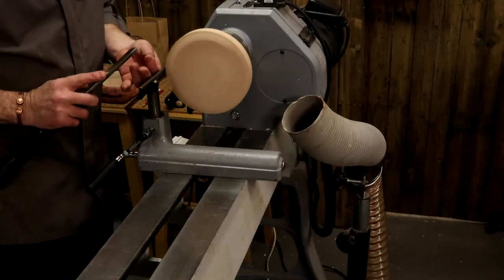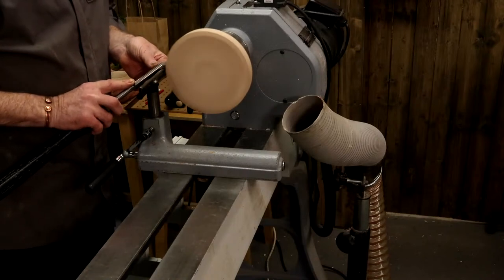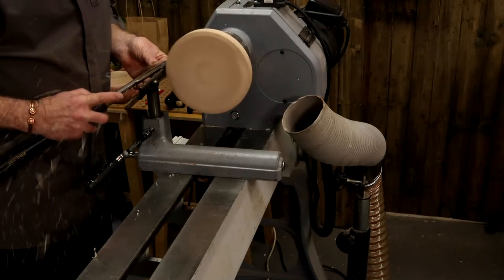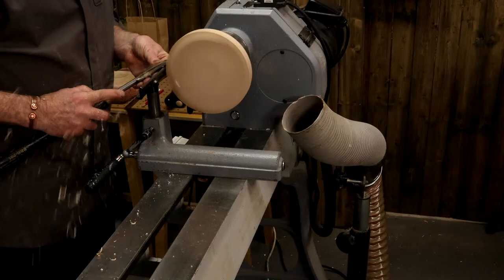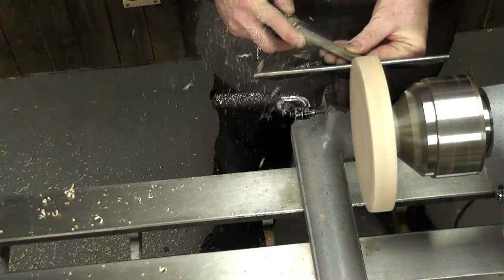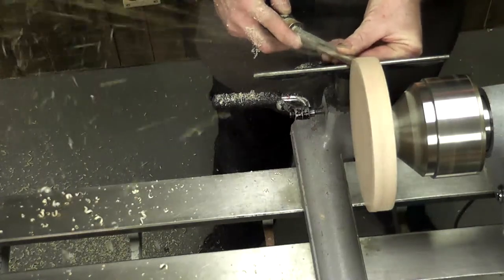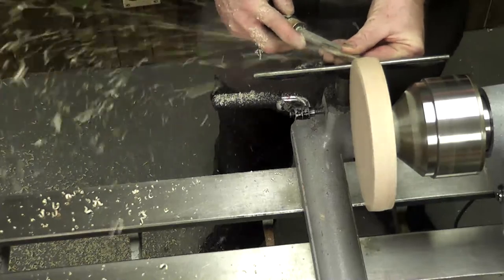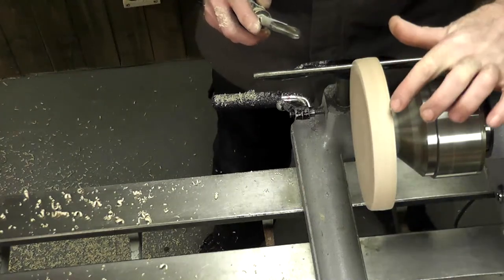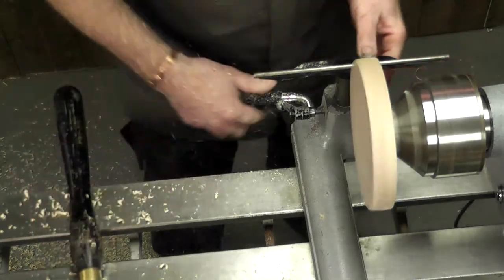So, finger and thumb, left hand, so important. At the moment, I can make contact just with the bevel. Flute is facing me directly. I can roll it. I'm going to push across. Now, as much as we've cut it to a circle, we're not 100% round. Left thumb's doing all the work at the moment. Now, pushing it across, right hand follows. As we said, real simple little thing, this. Down to a cylinder. Getting a little bit of bounce right-hand side, but I know there's a bark inclusion. Fingertip on the top, nice and clean there. That's good. Got to come round to the front.